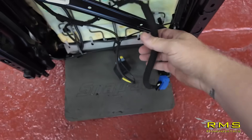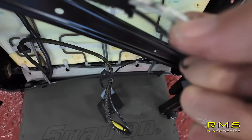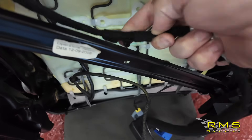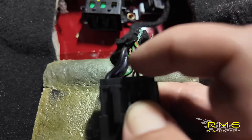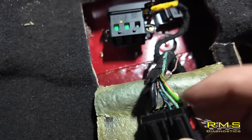Checking this wiring on the seat, it's actually chafed through on the control wire - the grey one - which has rubbed through because the securing tab wasn't in there correctly and it's been rubbing on a sharp bit of metal. Looking at how thick the wire is on the control wire for the relay, it's nearly the same thickness as a feed wire. Where it plugs into the multiple plug, we've got big thick mains in but this blue wire here is burnt right the way down to the loom. Look how thin that one is - it's a basic thin wire like a normal control wire - and unfortunately that's burnt right into the loom.